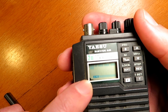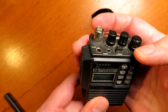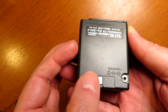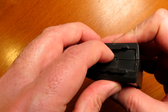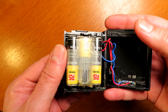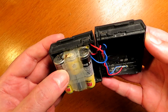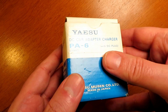This radio is roughly nearly 30 years old now and it's starting to suffer a little bit on the LCD — I've seen this on other screens where eventually the black side of the LCD creeps through and it'll eventually go completely black. The existing battery pack had already had the cells changed once — I did it myself. This pack didn't seem to be taking a charge, so I opened it up and found the batteries had corroded quite badly. I went on eBay and managed to find a nickel metal hydride pack with a charger for £8, a lot cheaper than the £30 for a new pack.